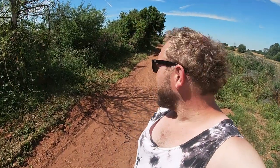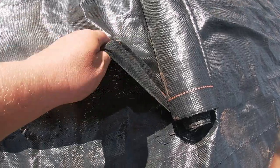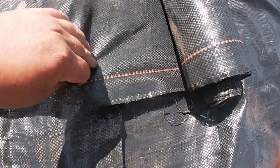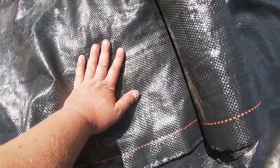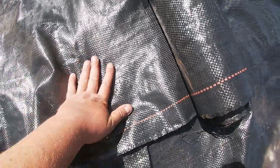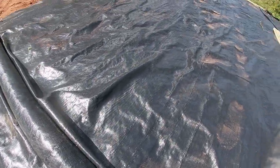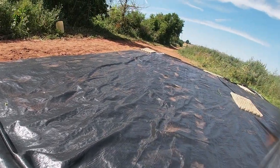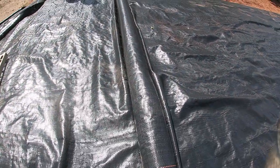All the hogging is in now. Last job before we can finish the track with stone is to put this membrane down. You've probably seen this before — it's basically a weed-barrier woven cloth membrane. Putting this on top of the hogging before we put the stone means the stone doesn't press into the bottom layer as much, so we should have a much harder-wearing top surface. It's just a case of rolling this big roll all the way down — it should be the width of the track.